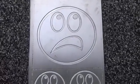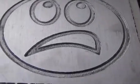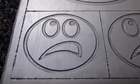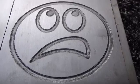We are back from the sink and this is some pretty amazing results. I am very, very excited — very happy with this. This is super deep, after almost three and a half hours — about three hours and twenty minutes at 6 volts. These are almost... I think we could probably do this. I'm about halfway through this plate, maybe a little bit less than halfway through. You would attach something to the back of this so you could stamp it and brand something like a piece of leather or wood.